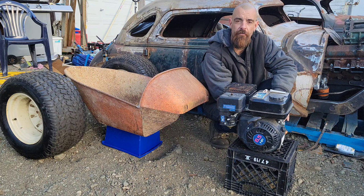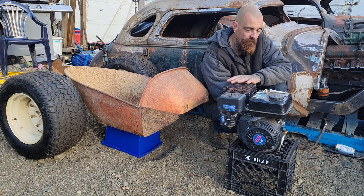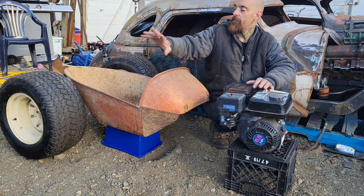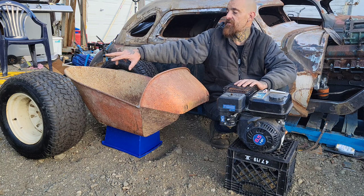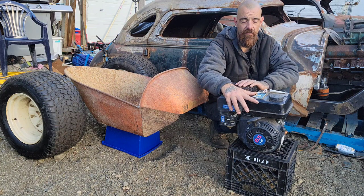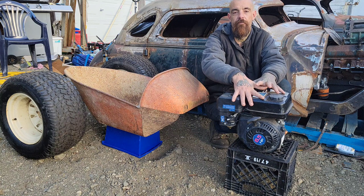Now, most of the go-kart parts you go out and buy are based around this motor. With this sitting here, ironically, this is the cheap, easy stuff. From here, you need a clutch for the motor. You need your chain drive, you need your sprockets. The rear end is going to need an axle, hubs to mount the wheels to. We need to worry about brakes, pillow block bearings to mount everything. These units are great for go-karts because they fit anywhere, they're compact, everything is self-contained, but these motors are designed to run at constant RPMs. You flip the throttle all the way up, you leave it there.